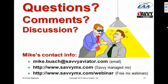I might have missed this part, but Gary would like you to explain more about the tool from Home Depot. Oh no, I was just talking about a digital inclinometer, a digital level to use instead of the dunce cap arrangement with a little swinging pointer. You can buy digital levels or digital inclinometers that have a little digital readout and a little button that you hit to zero it, and you rubber band it to the propeller instead of using a dunce cap, and it's just much more accurate.